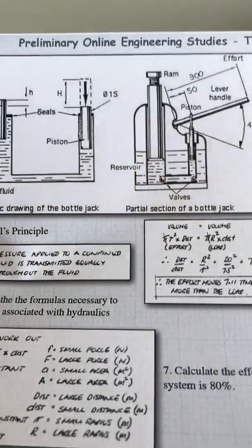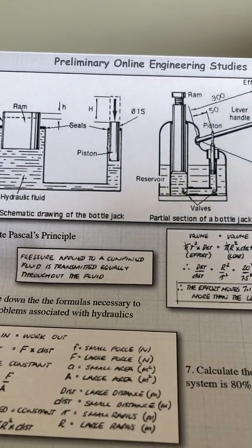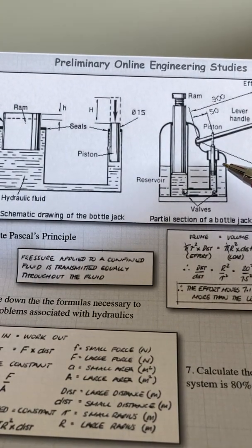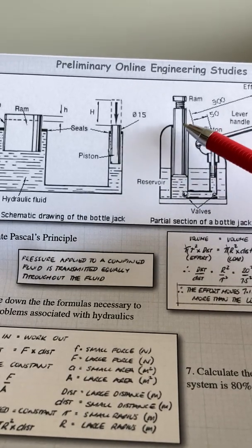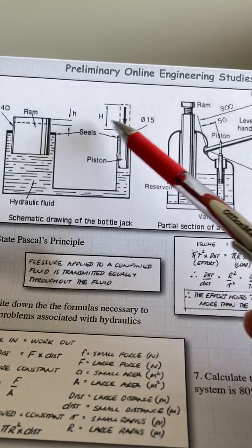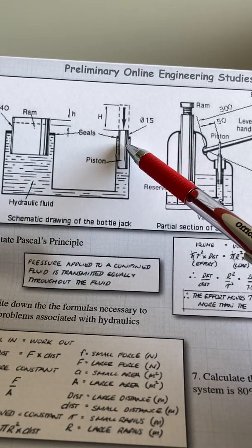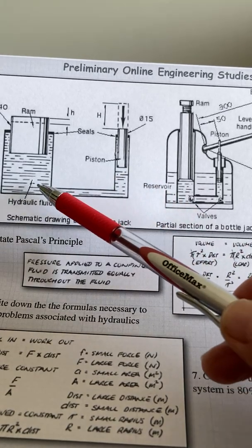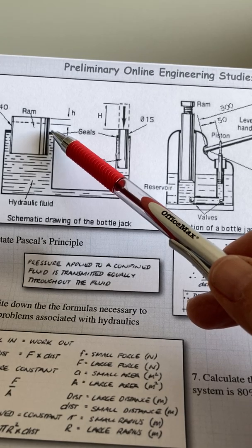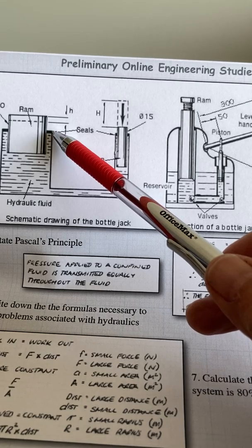The next thing I want to show you is a seal that I normally bring along. This is a seal used in hydraulic systems, and this is the exercise I gave you during the visit lesson. This is a bottle jack and you have to have seals to prevent the hydraulic fluid from seeping out. This is a schematic drawing showing a seal at the top and a seal on the top of the input piston. The ram is the output piston and this is the input piston. The high pressure hydraulic fluid will force the seal by a servo-ing action against the outer side of the barrel, and the higher the pressure the higher the sealing rate on the actual seal.